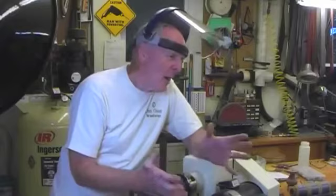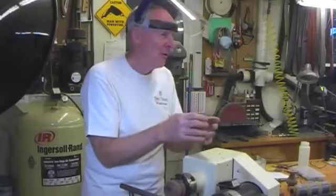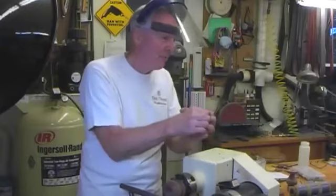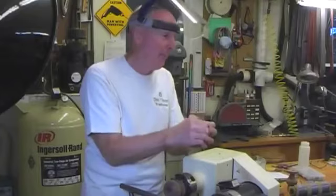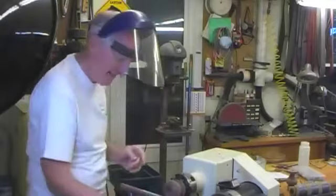I let them go for a couple days, and I pick it up, and the hose clamp falls off. I mean, it's shrunk that much in losing moisture. So that helps to minimize cracking and checking. And extremely important, if your pith is in that tenon, it's clamping it, so it's not going to move. And again, the operative word is minimize, not do away with.